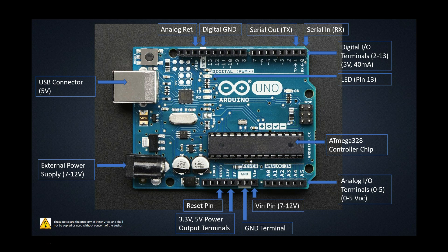There are a number of different LEDs embedded on the board. There's the LED tied to pin number 13. In addition to that, we have a power-on LED showing that the board is powered up, and transmit and receive LEDs for troubleshooting. If the power supply kicks out, you'll notice the power LED goes off. If you're trying to talk to the board but those TX/RX LEDs aren't chirping, you know there's something wrong with your serial communications. The LED on pin 13 is in parallel with that pin, so when you turn on that output, this LED will also turn on. We'll make use of that for our first project.